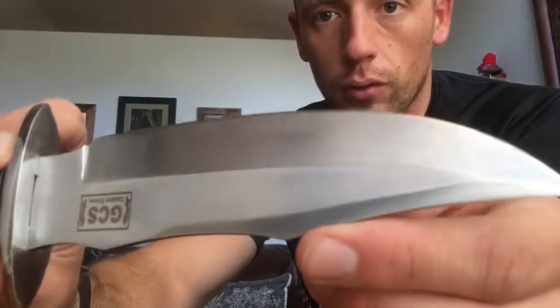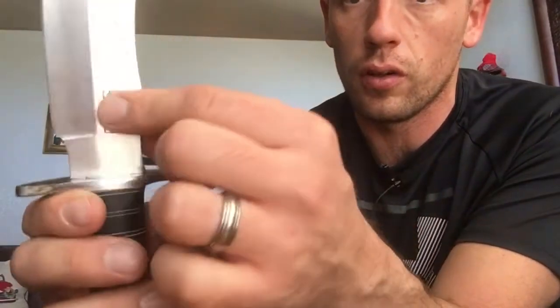Sticking with the pros: this is D2 tool steel. Used to be a German steel but I'm hearing it's starting to be made in Japan — I don't really care where it's made, I care how it performs. You've got a hollow grind — I'll give you a really good close look — it's a good hollow grind but not too hollow, just a little bit. It almost seems like they hollowed out what would typically be flat, so even though it doesn't look like it has a fuller, it kind of behaves like one, making the blade a little lighter.